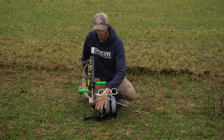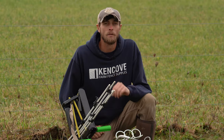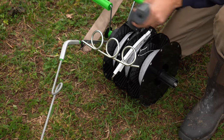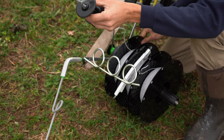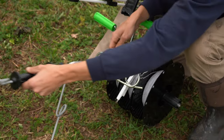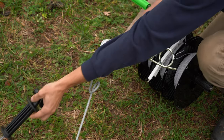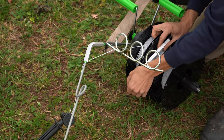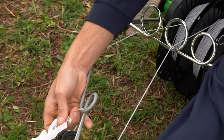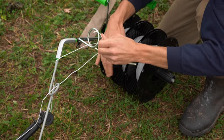We have three different gate handle options: a strainer handle, a Xammer handle, and just an open twine — we'll show you three different ways to connect to a fence. Before we attach to our fence or pay out twine, we want to make sure that our twine is feeding through our guides properly. For a larger style handle that can't feed directly through the guide, give yourself a little slack, put the handle over top of the loop and take the twine down around so it's fed through. If you're using the Xammer handle it's skinny enough to fit through the guide directly. On the third strand we can feed it straight through the guides without a gate handle.